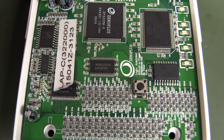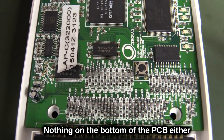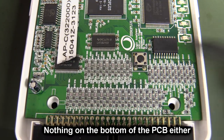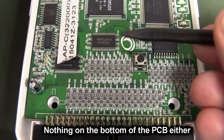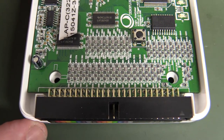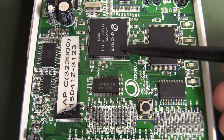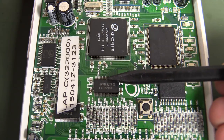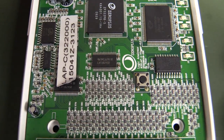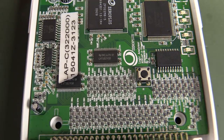This unit is supposed to have up to plus or minus 6 volts selectable threshold for each channel. Are they doing some sort of weird resistor summing thing going on here? Weird. So they're definitely not doing it in the probes, because there are no probes. It can't be doing it in the custom ASIC, because that's on the other side of the transceiver over here. You've got to do it on the input side of the transceiver. So I'm baffled as to how they're achieving that.